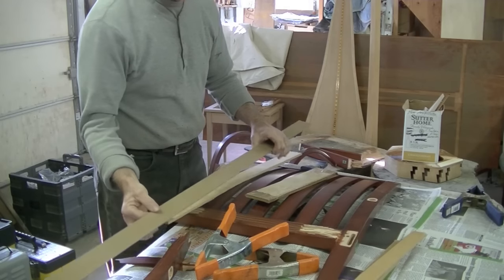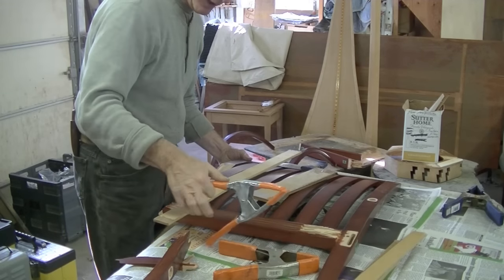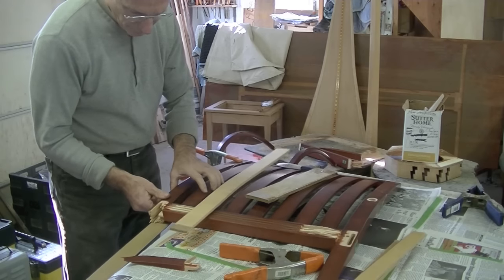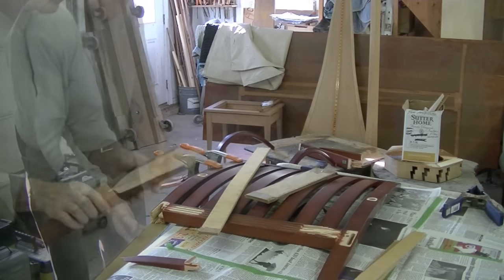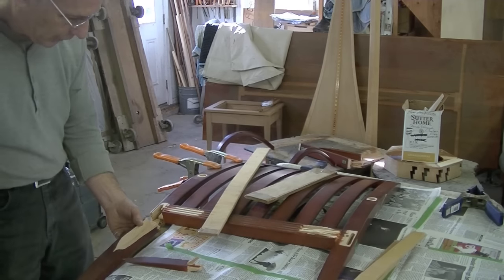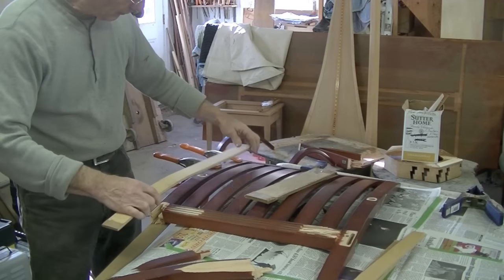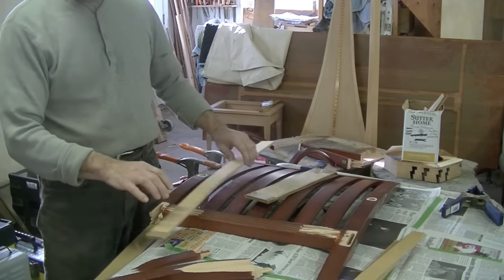I have a plan here. I took my straight edge and covered one side with tape. I'm going to clamp that here — I think it's just going to help me get everything in alignment. Then this piece goes here, this hooks onto the tenon right there, which lines this up and I clamp that. Then this bottom piece, I'll work epoxy all in there and line this up, tap that into position. This piece goes there, then I clamp this up. Then I'll go back and use this bending plywood to help clamp it and replace the spring clamps with regular fast action clamps.